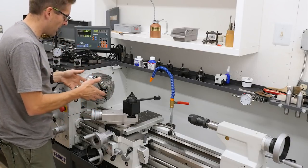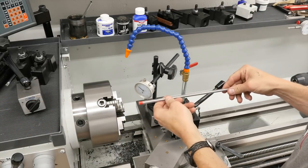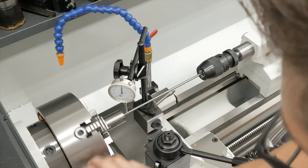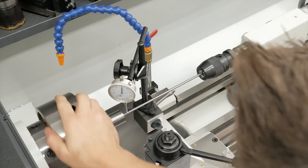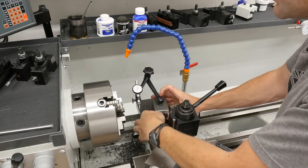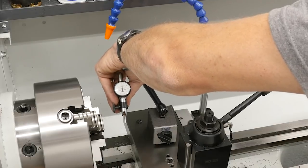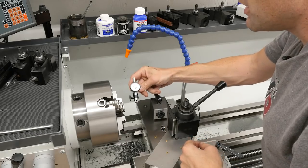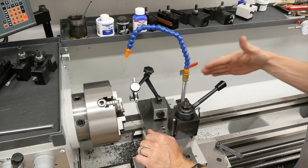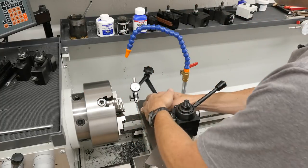Let's look at the tools you need to actually dial in the barrel. I used two sets of indicators: I started with my grizzly bar with the appropriate bushing inside the bore and a thousandth indicator on a generic NOGA base — that has the nodding feature, which is very nice to get things rolling. I checked at various depths, got that running true, then switched to another NOGA base with a multi-jointed arm and a head-nod feature to center the indicator range perfectly. I then ran the bushing in and out, worked the four jaws and the outboard spider until it was absolutely dead concentric.